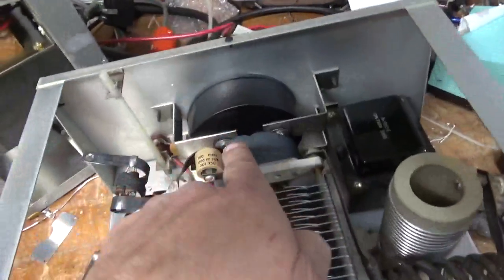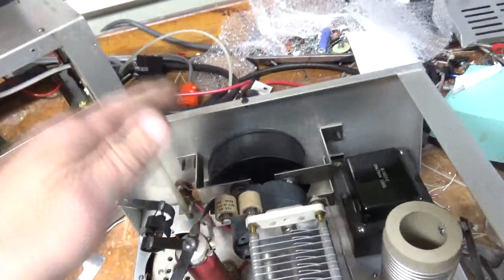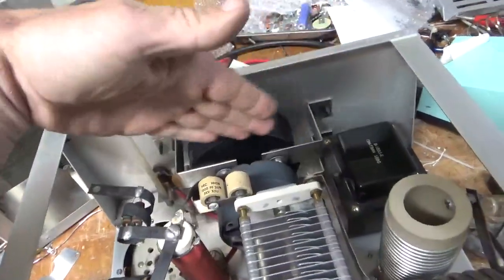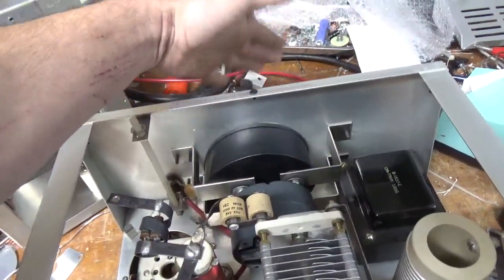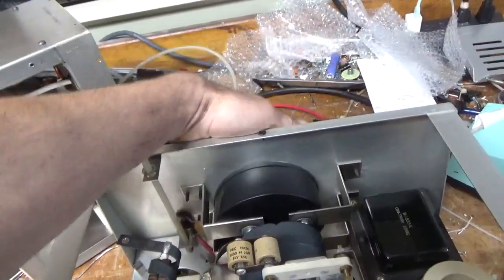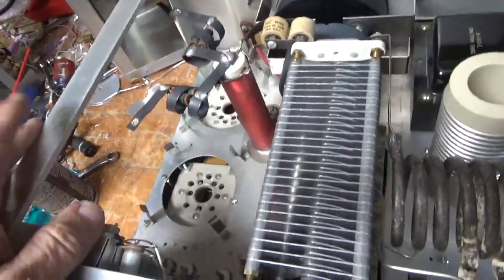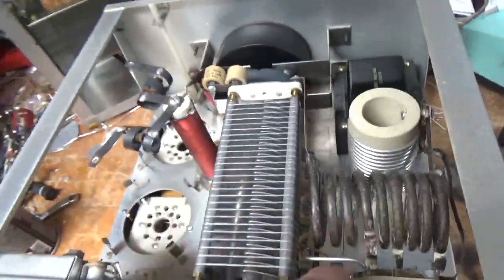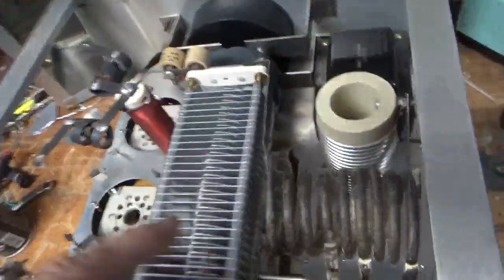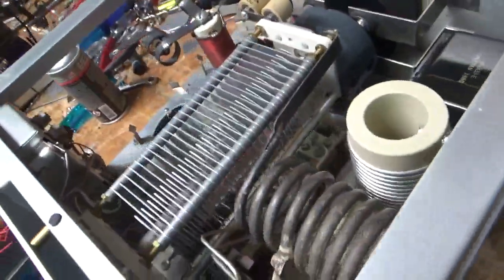Replaced the faulty plate blocking cap. I oiled the blower motor — it's always important, if you ship one of these, to put a piece of cardboard over the intake and tape it, because if that impeller gets damaged you're in trouble. It's got a brand new set of Pentalab tubes. Cleaned the output rotary switch with Deoxit Gold. Made sure the two screws holding the plate tuner variable cap are really tight, and I put a cap nut on the other side of the screw below — they are super tight.